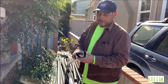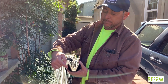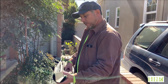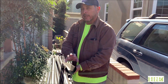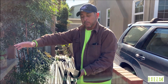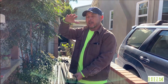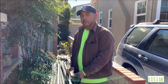So this is the aquifer pipe. It's basically a special ABS pipe — it's concave, and the gray water flows through the center channels or these side channels. We drill holes every 12 inches along the edge on both sides. What happens is that the water flows into the middle channel and creates a saturated zone. That saturated zone then allows it to have a moisture plume, and that moisture plume is where the plants feed from. That moisture plume can go four feet on each side and as high as 22 inches tall, so the plants have plenty of area to get moisture from.